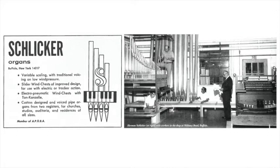So when an organist pulls one stop, he'll get anywhere from two to five ranks of pipes? Yes, that's correct. Perhaps I should explain here that a rank is one set of pipes. Each one corresponds to one note on the keyboard or manual. Each rank is named by the length of the pipe of its lowest note and by its sound. For instance, an 8-foot principal, a 16-foot quintadina, a 1-foot sifflute. The 8-foot pipe is considered unison pitch. In other words, it's the same pitch as that corresponding key on, say, a piano or something. An octave below that would be a 16-foot pipe, and then there are 32-foot pipes an octave below that. So there are pipes that are halves of the 8-foot, like 4-foot, 2-foot, 1-foot, each an octave above the other.